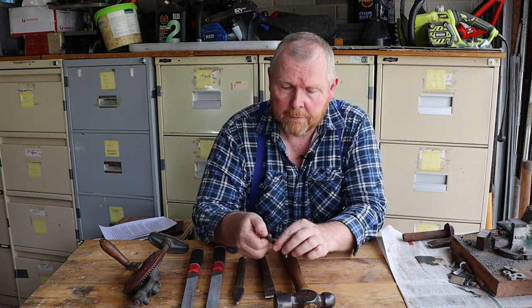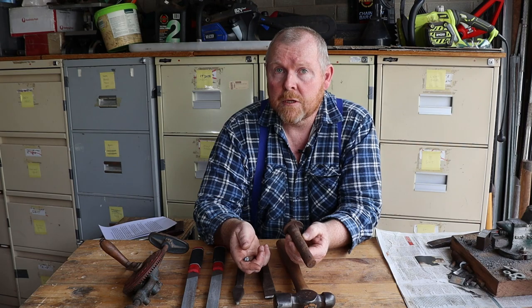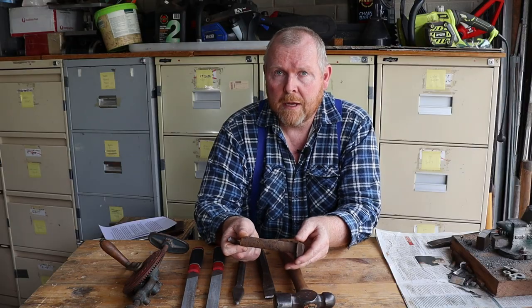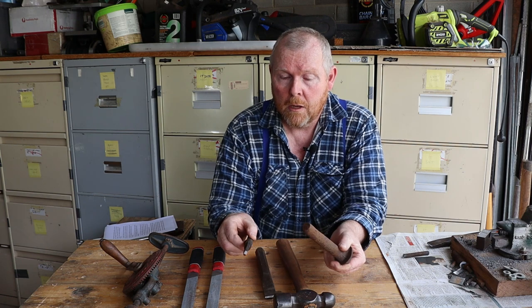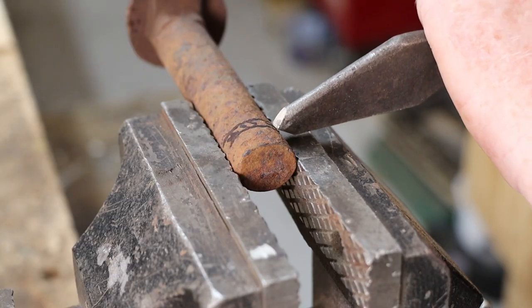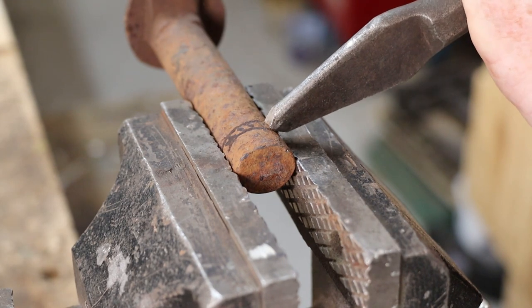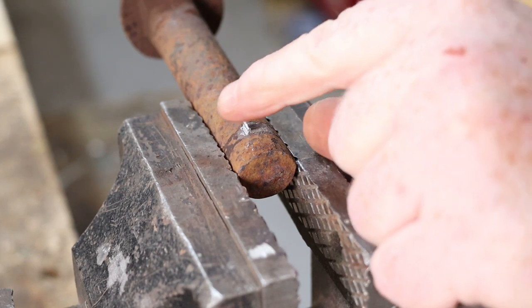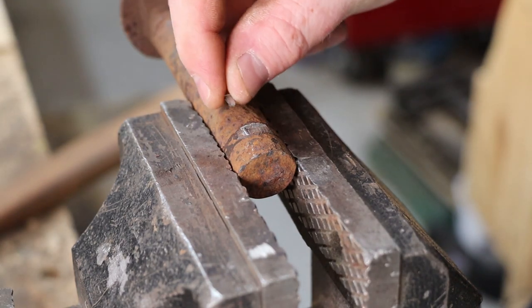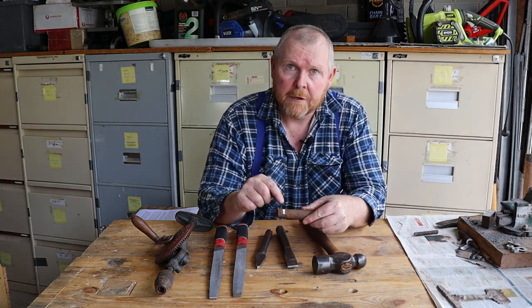This leaves a rough end which you'll need to smooth off with a file. That works fine for little stuff like this, but if you want to cut something a bit bigger like this old railway spike, then you're probably going to have to take a visit to your blacksmith to get it heated to red heat and then worked on the anvil. And if there's no blacksmith available then you're going to have to use a cape chisel to cut a trench across the material. This method's called chipping and it's pretty much the same as using a wood chisel — the only difference is that the tools are stronger and you have to hit the chisel harder.